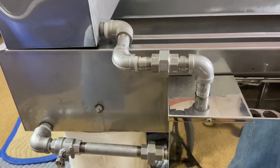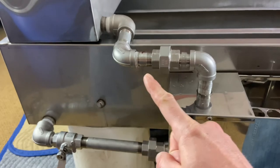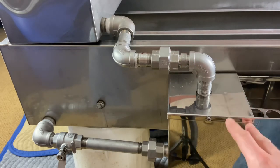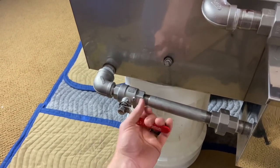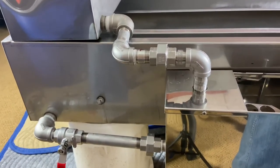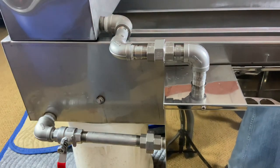Next day — I had to take a break and clear my mind, but as you can see I finally have everything connected. I have my one-inch inlet from my pre-warm pan now plumbed down to three-quarters. I've got a coupler here that I can take off to clean the pre-warm pan and the float box. I've got another coupler down here with a six-inch piece of pipe back to this valve so I can open and close it when I need to clean the pan. It looks a little different than last time, but I had to make it work — I was tired of ordering parts. I know it's not level, but once my brother and I make a bracket everything will square up.